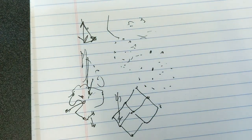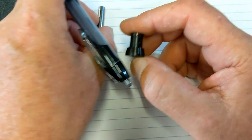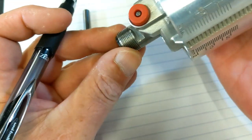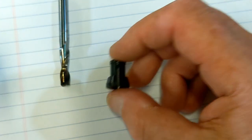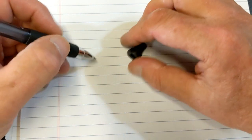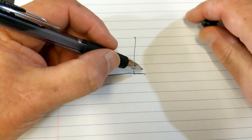We're going to take this to another level that is even less understood and probably has the same impact as the ball bearing effect. Let's say you put the collet up into your router bit shaft and there happens to be a little piece of sawdust right here on the taper surface. You go to tighten it up.